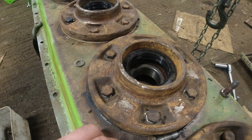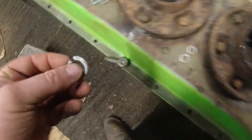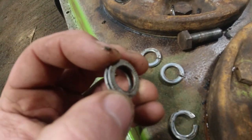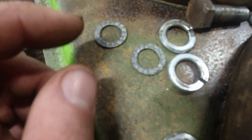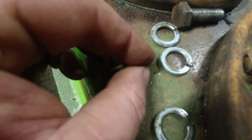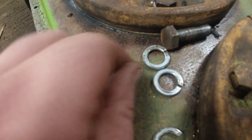Before we left we had all of these bolted down. While it was away we were thinking about it and I went for the spring washer option, because more or less it was an awful lot cheaper to use spring washers on all of these. But here is what happened — the spring washers all started going like that. Not all of them, but a few did, and this one had cracked. Just not the job. So we swapped them all out and put on Nordlock washers. A Nordlock washer, when sitting there, comes in two parts.